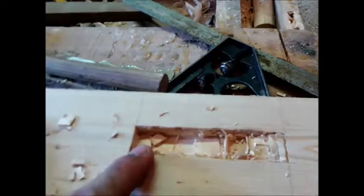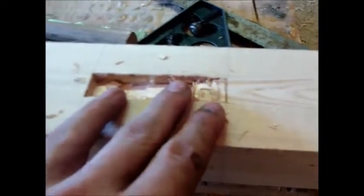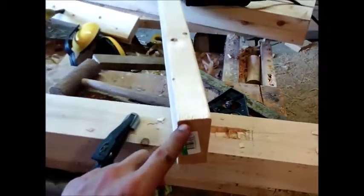Now, the idea here — if your chisel is sharp enough, it starts very shallow here and gradually gets deeper. If it was sharpened like my other chisels — and it's the only three-quarter inch I have — it should be down about an inch deep on this side. You go until you're about halfway through, then you flip and go the other half. And then you've got your mortise chop.